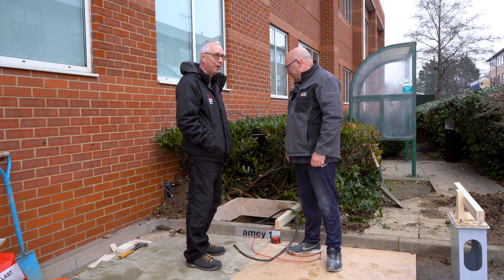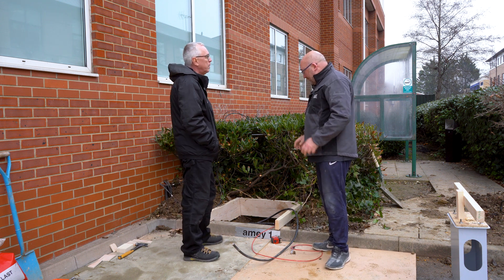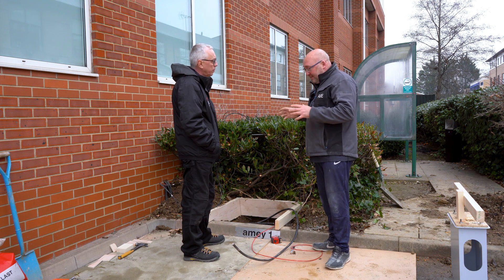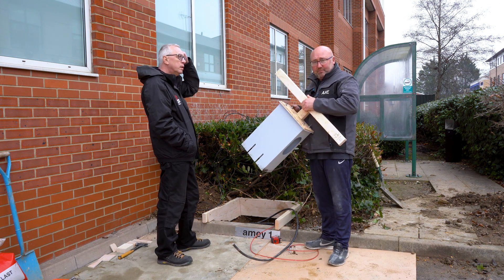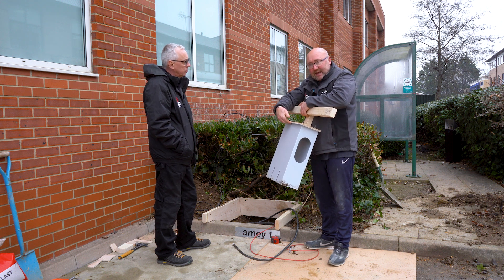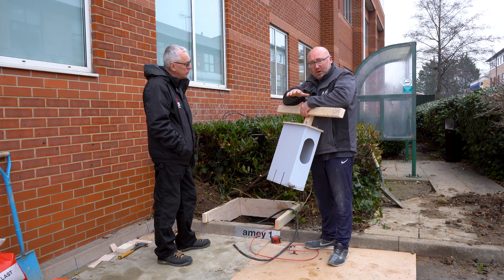Carl, I noticed that we've got a big hole in the ground here. Because they're floor-mounted units, the key to the whole thing is a big bed of concrete. And in that bed of concrete, we have to bury a galvanised routing kit. We always want to try and make the routing kit below the level of the concrete so we can shim round the edges when we put the charger on.